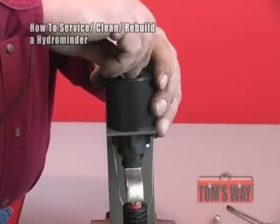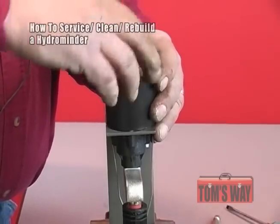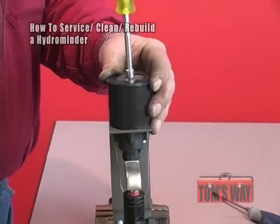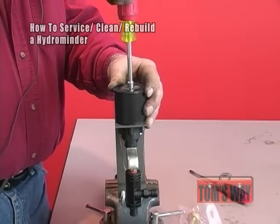Reinsert the cap. With a metal stem in it, it's easier to line up because you're putting a machine screw into it. With a plastic stem, you have a plastic piece with a metal screw going in, so you have to be careful to line it up to get it tight.